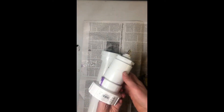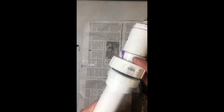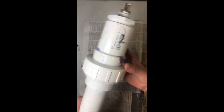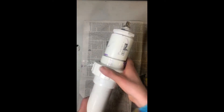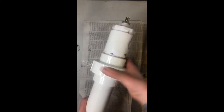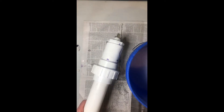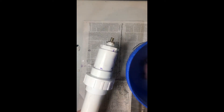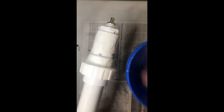Now that I've got this completely packed with steel wool I'm ready to put on the end of my scrubber. This part of the two-inch union pops straight through like this and then threads up. Because of the O-ring it's going to be gas tight, but I'm going to double check — starting the gas test, I've got my soapy water here.